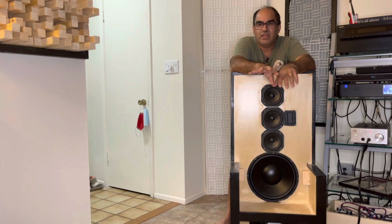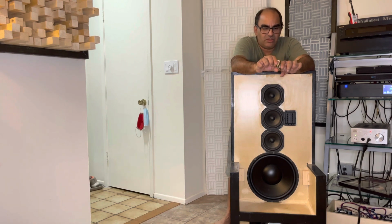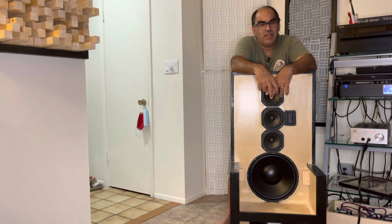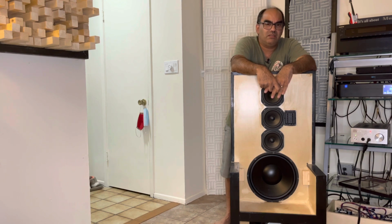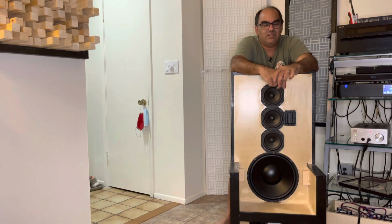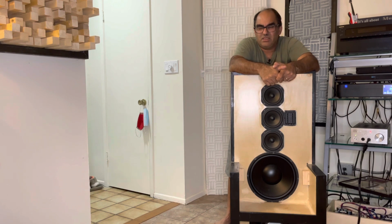Anyhow, the way the thing is designed is you have the 50 volts that comes in, and then there's 2 resistors strapped across each capacitor, tying one to the other. So it's a voltage divider. It's a cheesy way to do this, and I remember when I was rebuilding the Bose EQs a few years ago, same thing. You come in with 18 volts, and then the first cap with the series resistor drops it down to 16 for one section of the circuit, and then another series resistor drops it down to I think 16 volts or something like that. It was a pain in the ass, but whatever. And those are low current circuits anyways, but this is for a power amp.